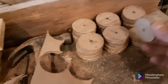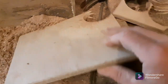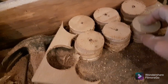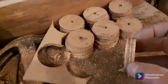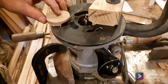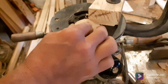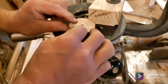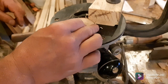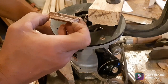There are 12 blanks, ready to get to the next step. That sheet I showed you, I used all of it — I was short one, went looking around, had another scrap. If you don't have Maranti or marine ply, I'd recommend it should be marine or exterior grade. That gives me two extra blanks to play with. I have a router table but I don't bother setting it up. I have one of these Jurgensen clamps — I just clamp it all up. I have a little stop clamped here so I can come off this, because your fingers are going to be quite close. I highly recommend you guard it. With this little stopper, I can get on the bearing without it taking off on me and maybe catching my finger.